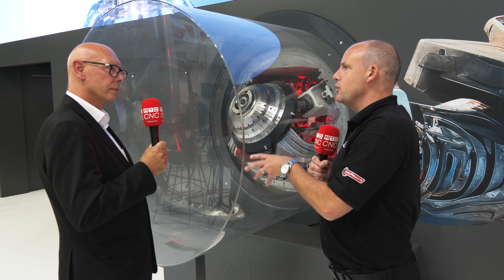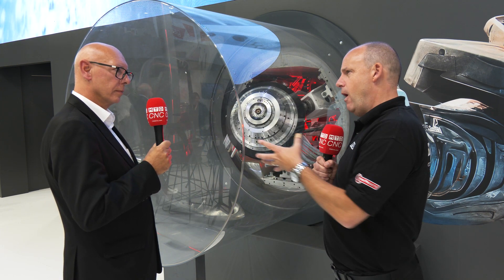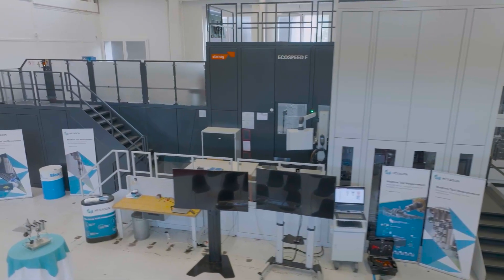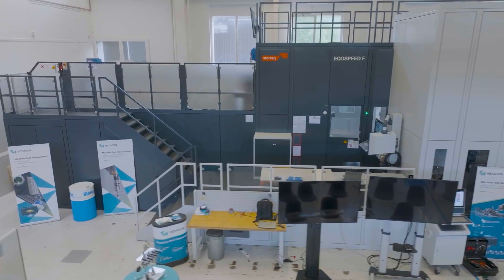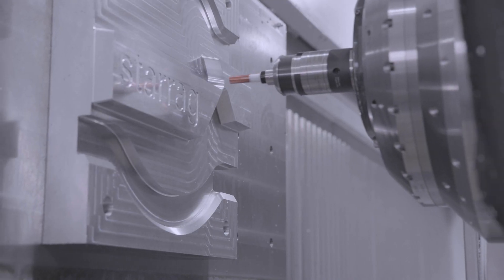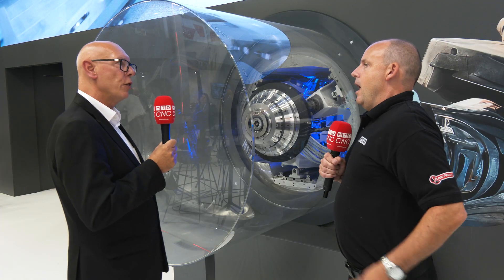Because of the way it moves, often you're moving the head to the part rather than having to keep moving the part to the head in some instances, which is an advantage — flexibility. The whole assembly is the Z axis moving forward. All three axes inside the head are moving simultaneously. When one axis moves more than the other two axes, it tilts the head, and that's how we get the A and B movement.